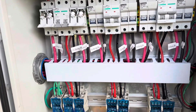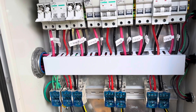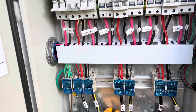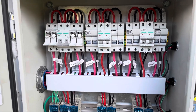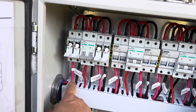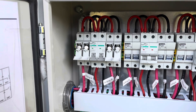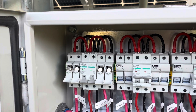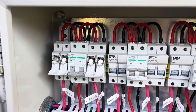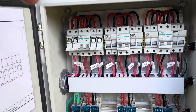The rest of this panel is energized - there's 300 volts DC in here right now. So you need to use extra care. If you're doing this yourself - and you probably ought not do this yourself - you need to be extra careful around these live circuits. I don't have a way of turning these strings off short of going to my MC4 connectors and disconnecting them. I'm not going to do that; I'm going to work it like this. If you're not qualified to do this, hire somebody who is.